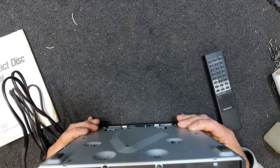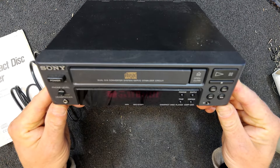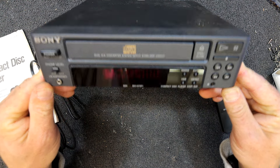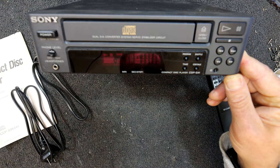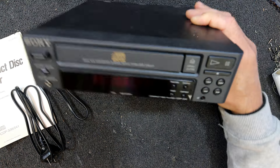The main sort of issues with these, like mostly Sony's, is you get the spin motors playing up in them and causing them to skip, because these should have the KSS 240 type mech or something around that era. They have the long-shafted spin motors that used to seem to be the main issue with these things.